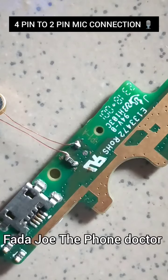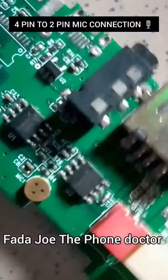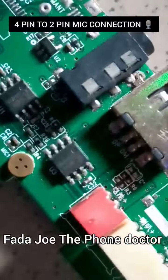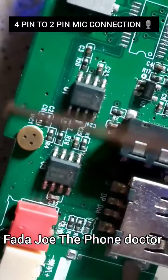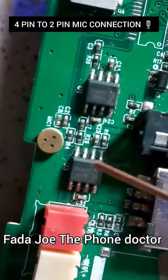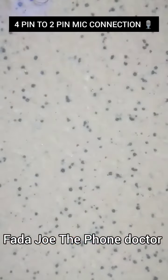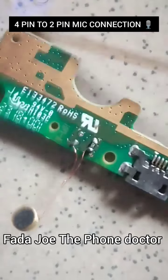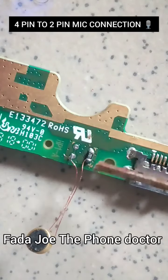Some of you asked where to get this resistor. Get it from Bluetooth panels — it's available. Check Bluetooth and all panels; you will see them even on phone panels. I get all these resistors from old Bluetooth panels that are no longer working. I test and read each resistor, and when it's 1k or 2k, I remove it and bring it over to this board.